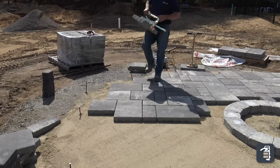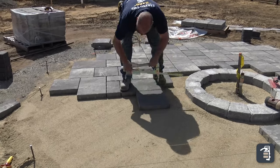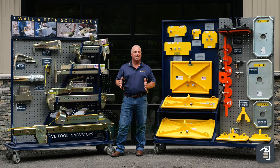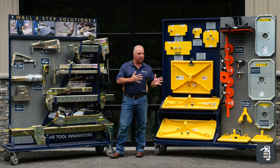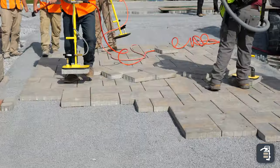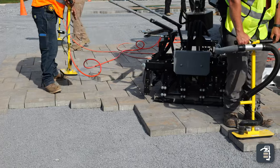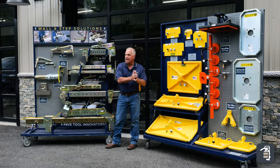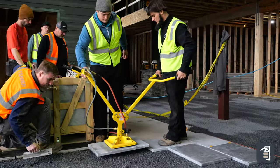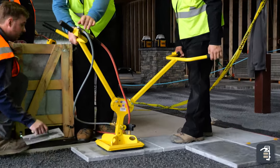The difficult part is if you have to extract the paver — say you have a low spot or you find one that's got a blemish or a chip. To extract that paver and pull it back out can be quite challenging with a clamp because of the way the teeth work on the sides. When it comes to suction equipment, there are a lot of benefits. It's very gentle on the pavers because of the foam pads. You can pick the product up easily without worrying about chipping edges, and being able to set that product in place up against the house. With your clamp you're not going to be able to get up against there because of the metal, but with suction equipment and the pads being very streamlined, you can get tight to the building.